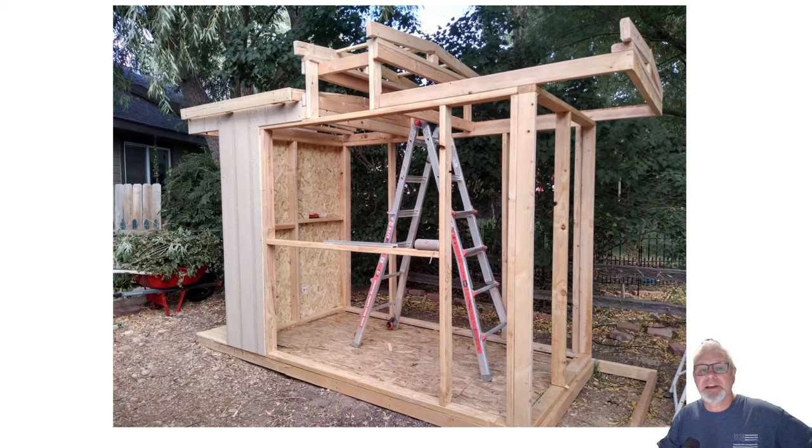Here you can see the trusses — just a triangle shape built out of two-by-fours, all needing the same slope. The roofing sheets have to be strong, so you put the trusses at a certain distance apart with supports in between so a two-foot snowfall won't collapse the roof. I decided not to use metal roofing — stronger but more expensive and harder to cut — and instead used corrugated plastic, which you can see through slightly, allowing some sunlight in.